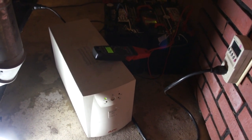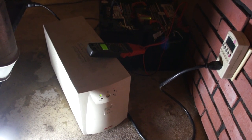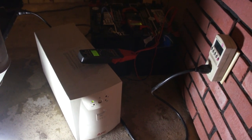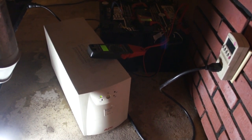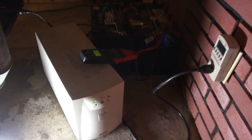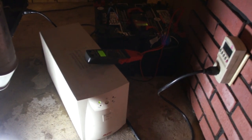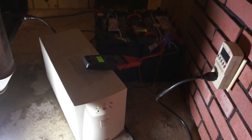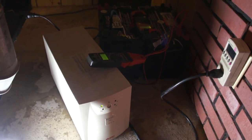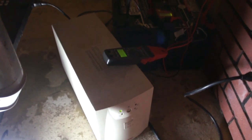If you're in an apartment and don't have room for a generator or can't run one due to ordinances or space constraints, this can sit right in your apartment. If you're worried about a lead acid battery venting, these don't really vent much, but you could put a plastic boot tray under it. You could use a gel cell — those don't vent into an interior, they're a sealed unit. You could also use an AGM battery, but you would need to check whether the APC unit is compatible with those battery types.